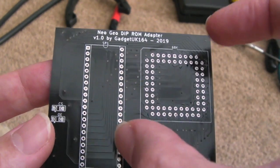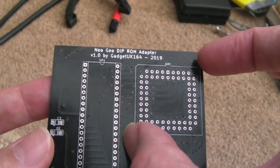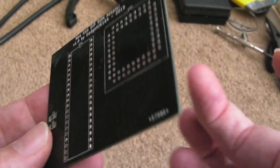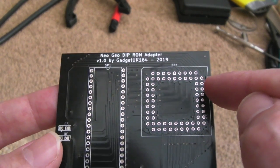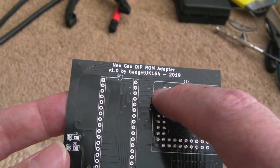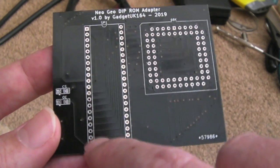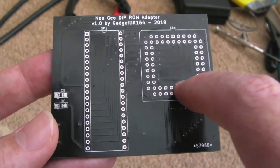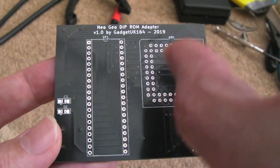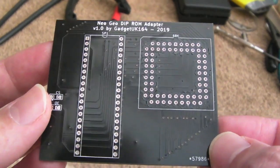It's really important when you look at the chip from this side up, the socket this way up. When you flip it over, the orientation of some of the alignment of some of the pins is flipped, so you end up joining incorrectly, if you see what I mean. So say every other one here was okay and the other ones weren't, because they were corresponding to different pins on here than if the socket was on the other side of the board, if that makes sense. It's just something I totally overlooked.